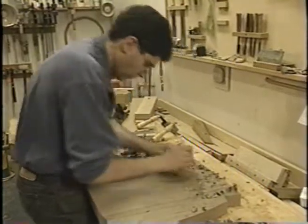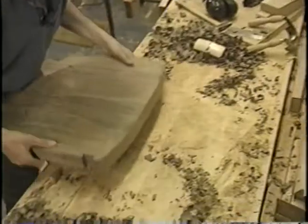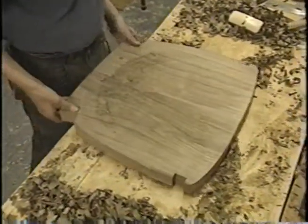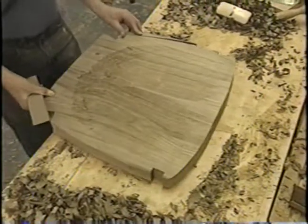Two hollowed ramps for the legs will slope up toward the front, where they'll be separated by a well-defined ridge. Three inches or so from the front edge, the hollows ramp back down again toward the front. Flipping the seat around on the bench makes it easier to work both the steep slope at the back of the seat and the fronts of the leg hollows.